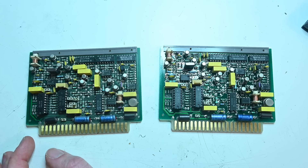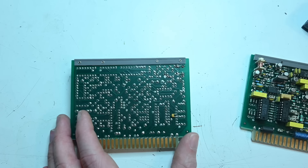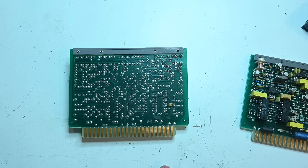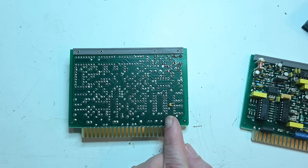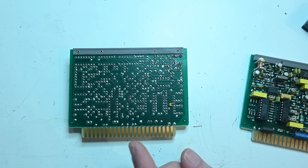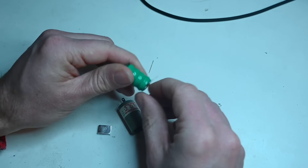So what to do about it? I've deployed a little workaround — I put an 18 picofarad capacitor across the clock inputs and ground on the back. This is going to snub out any ringing which may be occurring on the clock input of this chip. As for why there's any ringing there, I'm not really sure — I'm not even able to measure it because putting the oscilloscope on the input fixes the problem. It must be very faint. It looks pretty clean on the scope, so I think this is a reasonable workaround for the time being.